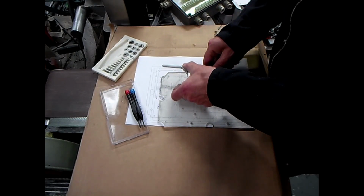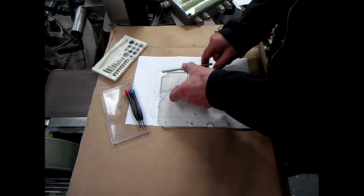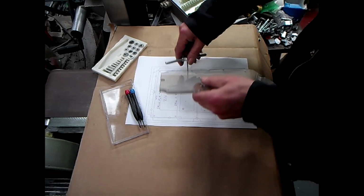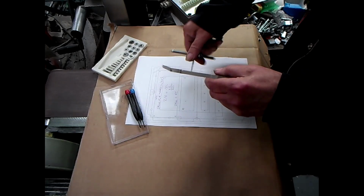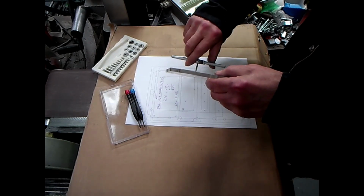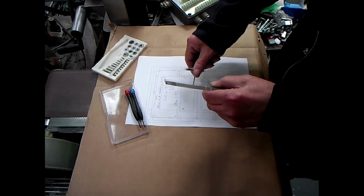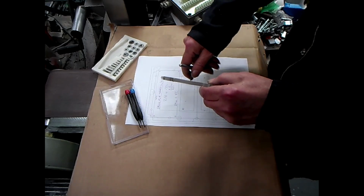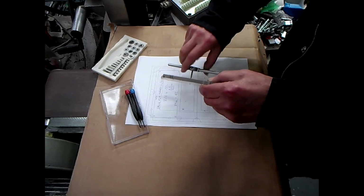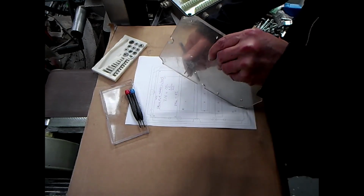When normally run with the spindle on, the output from the sensor is read, and the difference between the value and the value stored in the EEPROM is saved. This is done another 31 times, and each time the result is added to the previous stored value and then halved. The final result has the lowest 2 bits, bit 0 and bit 1, cleared for hysteresis. If this final figure is greater than 0, then a 1 is shifted into a 16-bit shift register, else a 0 is shifted. The values used are 8-bit, as derived from the 10-bit A to D input.